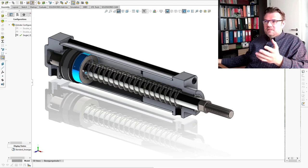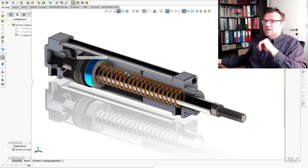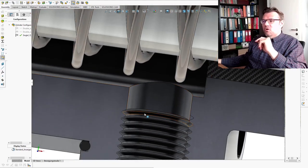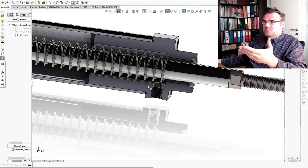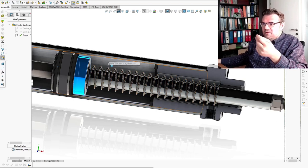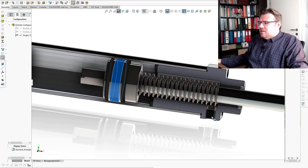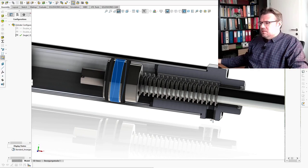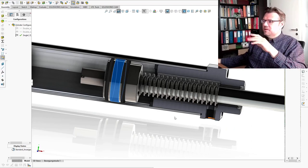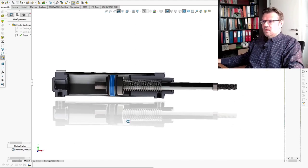This is a so-called piston cylinder, because it has a piston separating one side from the other. So there's the pressure side and there's the no-pressure side. However, I need here some ventilation hole, because I need to get rid of the air on this side of the cylinder. Here is air inside — if I want to move the cylinder in this direction, I have to get rid of the air on this side, and this is a ventilation hole. There's usually nothing attached — just maybe a filter element filtering the air, a sinter filter element, something like this. So this is how this looks like: a single acting cylinder.